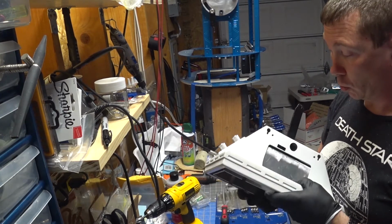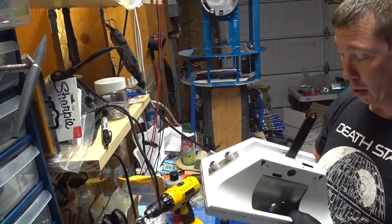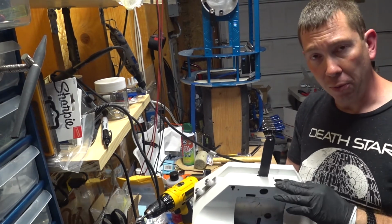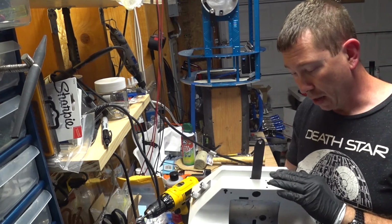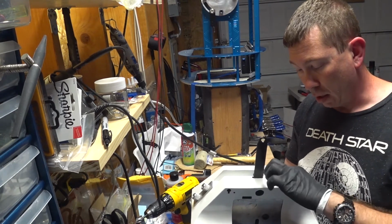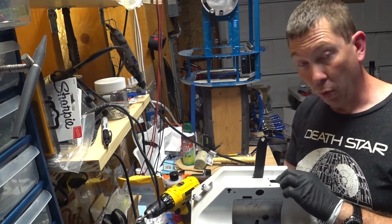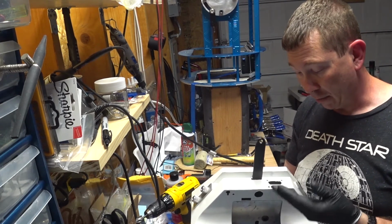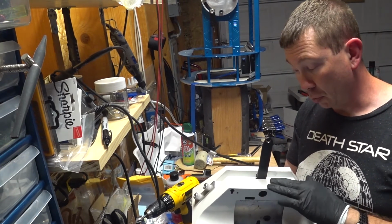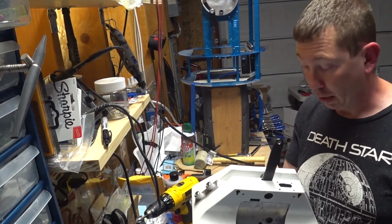Yeah, so really all that we need to do is fix that nylon lock nut, and then, I think I mentioned before, I'm going to put a piece of galvanized steel, cut it. That'll be probably 2 layers thick, maybe 1. I'll stick it into the underside, and then I will push JB Weld steel through here, let it level out, and that should give us a really good bond, and then this will be able to be smooth and sanded, and we can do all the things and make this look pretty.